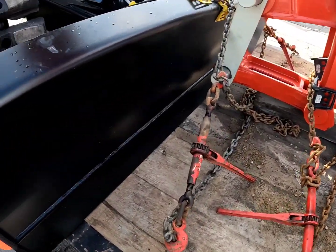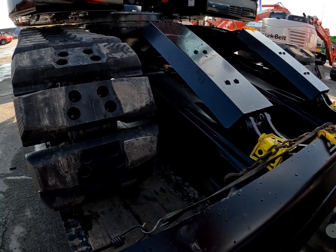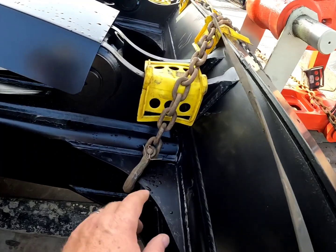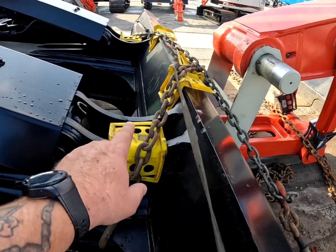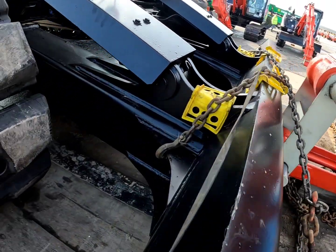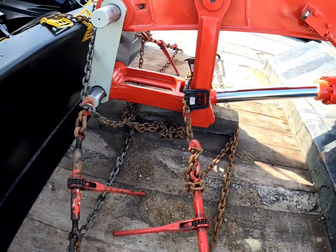In the back here it got a little tricky because it has this blade, so it's difficult — you can't really get to where I put the D-rings on the other side. What I did was hook right here and got super creative with some edge protection, came up over the blade and down to the other side. I had to edge protect here, here, and then this lip on the inside as well. Chain hook chain that way, hook chain came this way, and then one required chain over the boom.